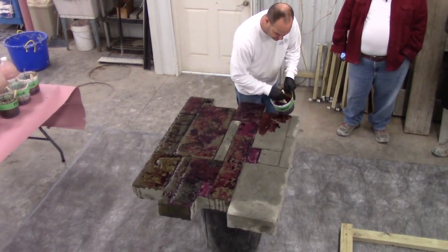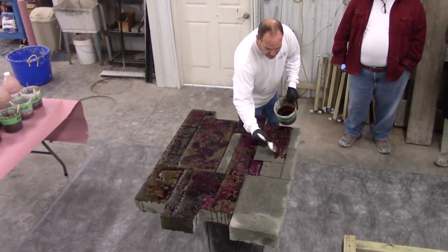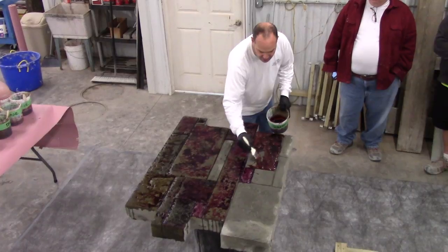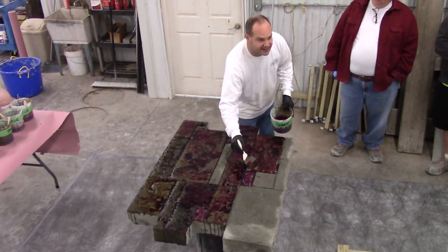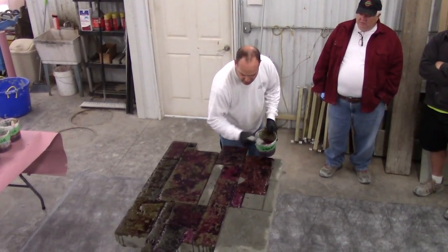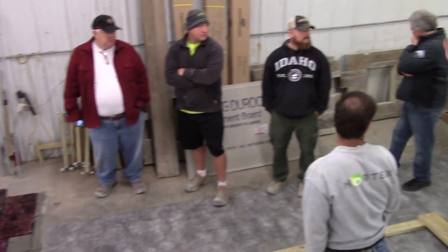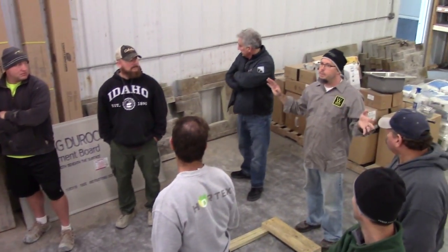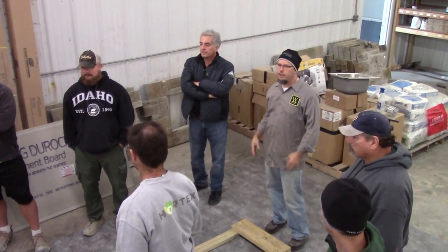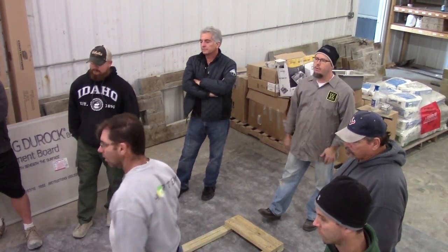Can they stain the panels and then put them together? Exactly — it's totally easier to stain these while they're laying down. You could never get some of these color anomalies if we had to stand this up and spray it. That being said, you certainly could spray them afterwards and just get color that runs beautifully. A lot of people stain that way — just do big wafts of different colors. But these are going to be more precise.